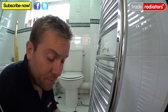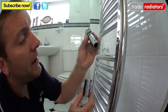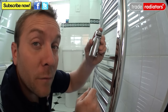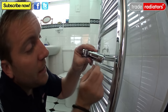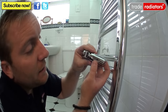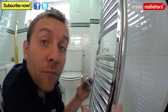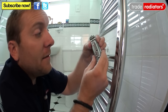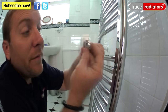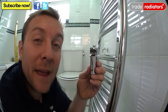Now let's go back to the box of brackets. There's something especially important to notice about these for curved radiators. The part that attaches to the radiator attaches the same way for all, but there's an angled piece that compensates for the curve when going onto a flat wall. There's also an adjustment screw — you can set how far the radiator stands out from the wall, which lets you pack on more towels but means it protrudes more into the room. Pop off all four brackets and the special fascias and keep them safe.